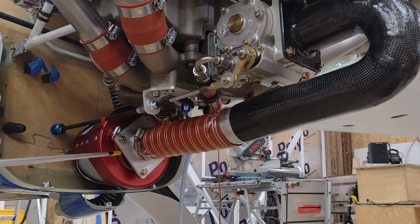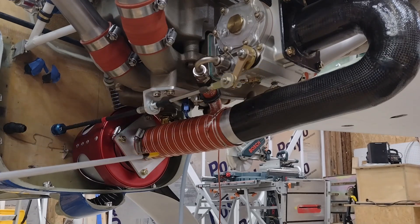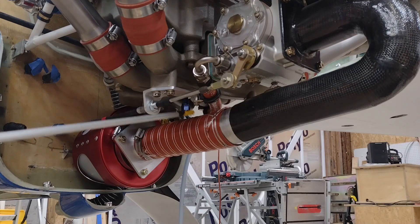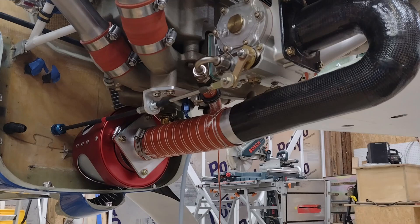I was only planning on having maybe four to six inches of skeet tubing and then the fuel injection servo facing forward underneath the cold air induction plenum. The problem is that with cold air induction it extends vertically down quite a bit more than in your standard configuration with just the hole on the bottom of the oil pan on a regular Lycoming that you connect up either your fuel injection servo or a carburetor.